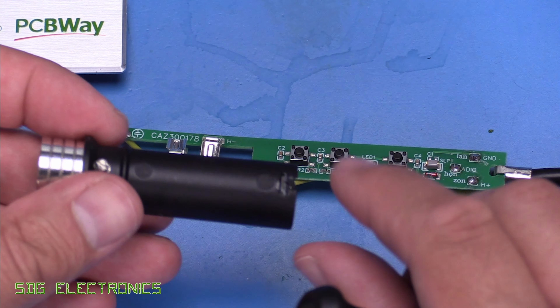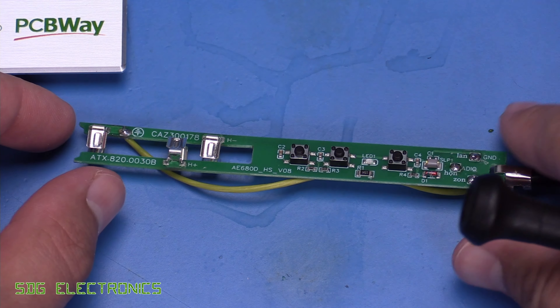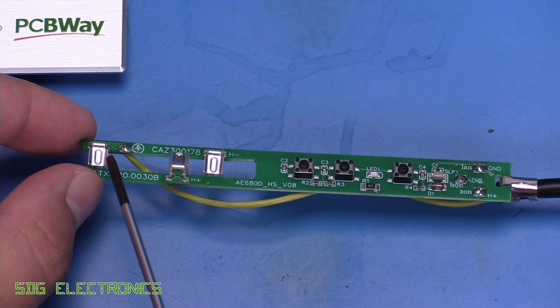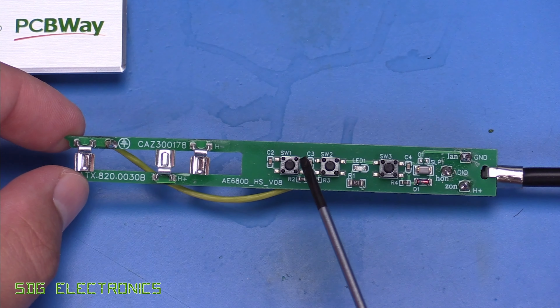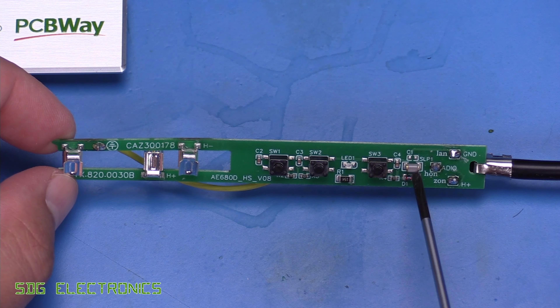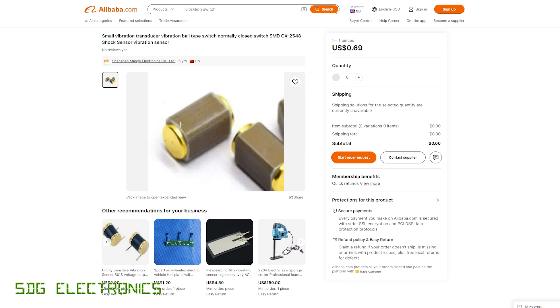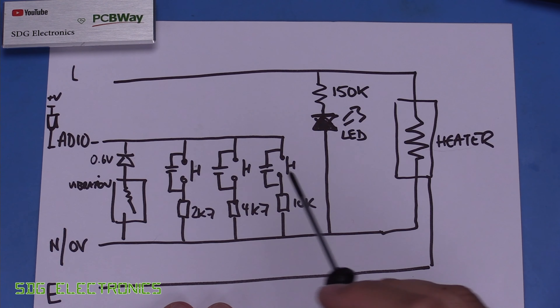With a little bit of force we managed to get inside — unfortunately the plastics are damaged as it was all glued together, so I probably won't be able to put this soldering iron back together. This is what the PCB inside the handpiece looks like: we've got the little terminals — one earth and then the two heater terminals — some tactile switches with a few passive components, the LED, and a little vibration sensor. These are just little switches that are normally closed, but a small amount of vibration is amplified by the armature inside and the switch opens briefly.